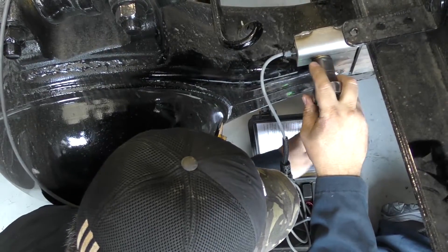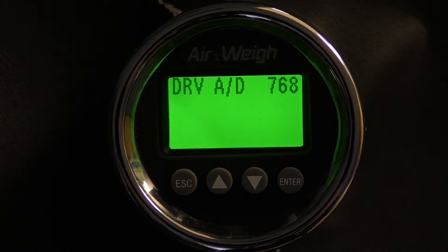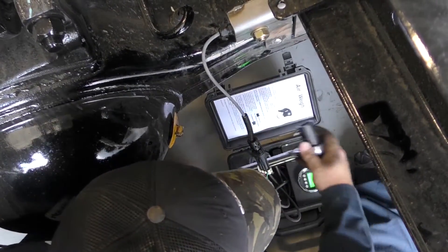To adjust your AD values, apply either upward or downward pressure to the plastic nut at the end of the sensor using only your fingers. When the AD values are between 750 and 1250, maintain pressure while torquing to 60 foot-pounds. When you have completed the initial torque, if your values remain between 750 and 1250, finish torquing to 120 foot-pounds.